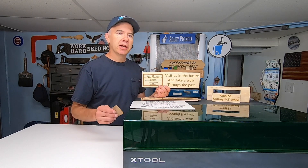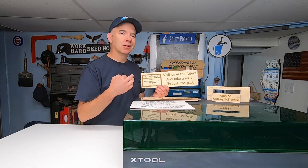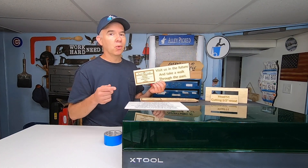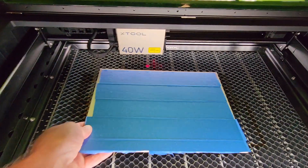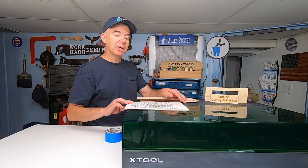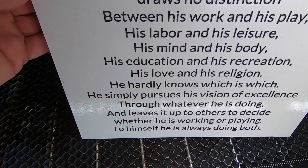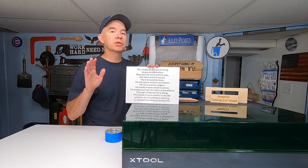You can adjust the laser settings, air pressure, and speed, but there's often burning still around the edges, and it doesn't just wipe off like it does on acrylic. There are some ways you can avoid or minimize this burnt edge syndrome. You can cover your project with blue painter's tape before engraving. That'll require just a little more power to cut through the additional layer of tape, and if you do this on a project that has a lot of detail, you're going to need to pick out all those small cut pieces of tape, which can be quite tedious, but it does work.